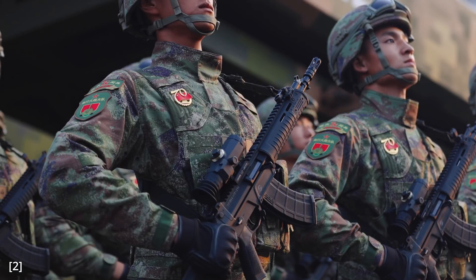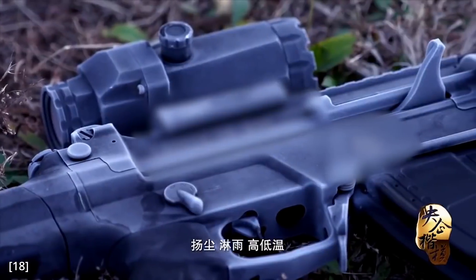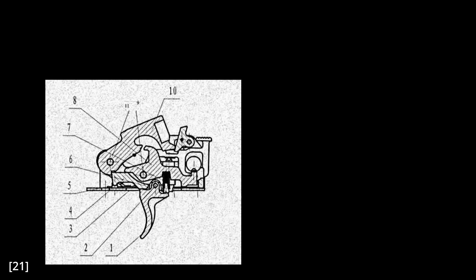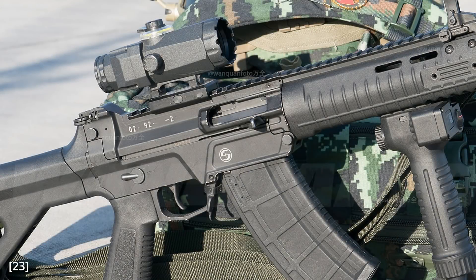That concludes my analysis of the new QBZ-191 small arms family. It contains a lot of AR-15 DNA. However, the idea that this somehow means the Chinese are incompetent is a little unfair. Their engineers made real efforts to improve upon certain elements — like the sheet metal trigger pack housing, the dual chamber gas block, and even the charging handle. On similar side-charging AR-15s, the charging handle must be removed before the bolt carrier group can be removed; making the charging handle run in the gap between the upper and lower receiver was pretty unique and has no ingress points for dust and debris. You can argue it's an answer to a question nobody asked, but it's a damn good answer nonetheless.